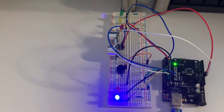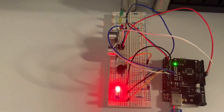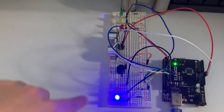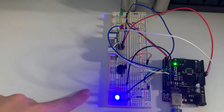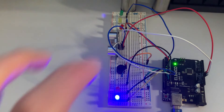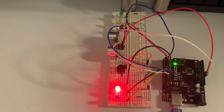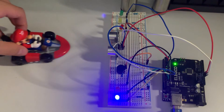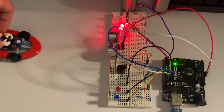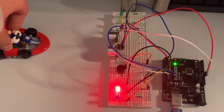Today we're going to learn about these LED lights, the ultrasonic sensor, the buzzer, and the flickering lights which use a for loop. A quick note about the logic: the buzzer is synchronized with the light changes. When distance is greater than 30, the blue and red police lights will flicker and a buzzer will sound. As the driver gets closer, a red light triggers via the ultrasonic sensor for a certain conditional, with higher pitch. We also have yellow and green, each triggered for similar distance reasons.